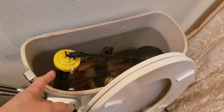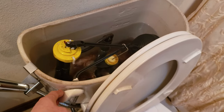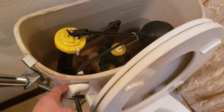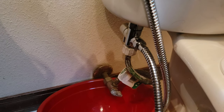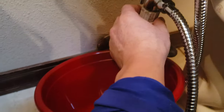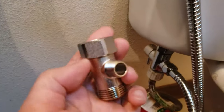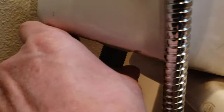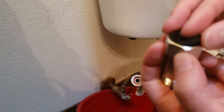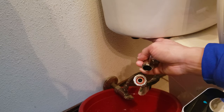Now I can insert the screws into the hole and tighten them with the nuts. The next step is to drain all the water from the reservoir without it refilling. Shut the main valve so it doesn't refill, then hold down the flush to get rid of the water until it drains all the way. Use a pail to collect any water. Now I'm going to loosen the cold water valve and the main valve to drain the water from the line, because we're going to insert the T-valve connector here. Place the big washer inside the T-valve and insert it onto the thread.